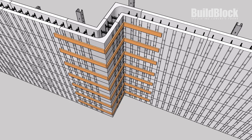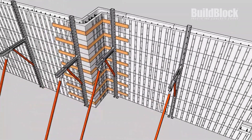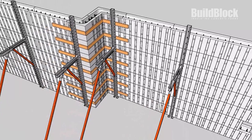If you are building a multi-story structure, it may not be possible to brace the outside with strapping. In this instance, you would still place the interior strapping, but instead of the exterior wood strapping, make sure your horizontal rebar completely overlaps in this area. Also zip tie it to the web every 6 inches. This is then repeated each course, maintaining the interior wood strapping and bracing and alignment system. This method eliminates the need for exterior wood strapping while still reinforcing the short corner.